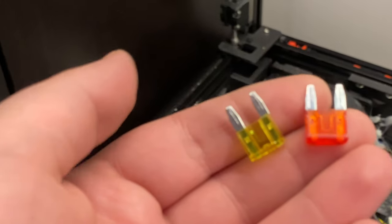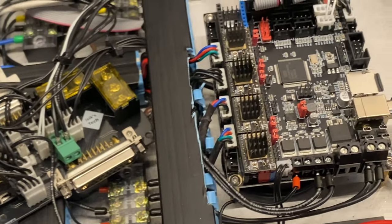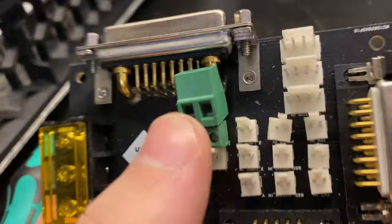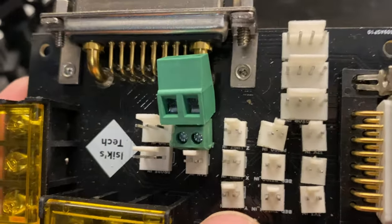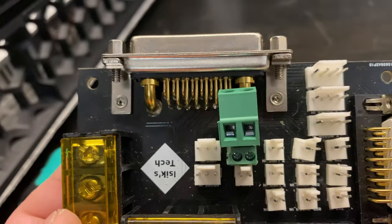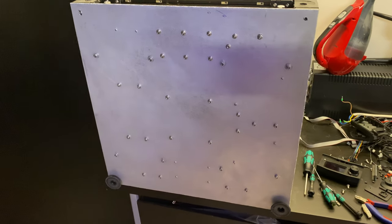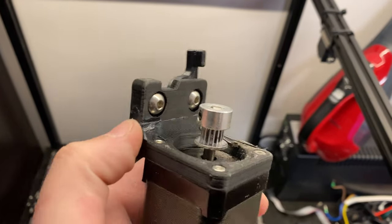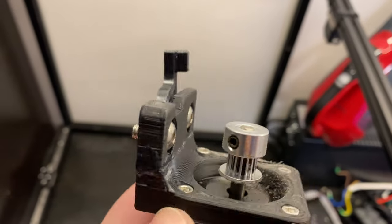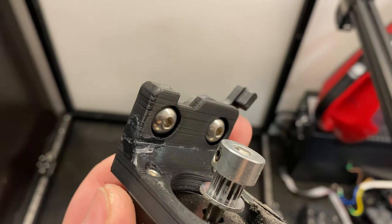The fuses are not blown, so that's not the issue — something else is killing that board. My bet is one of the stepper drivers. I also forgot I had this — the hot end heater was planned for just a regular JST connector, then I changed my mind and added the terminal, which is fine but definitely not the world's most elegant solution. I broke this part many months ago when I was first doing the 2.4 upgrade, didn't have a working 3D printer, so I super-glued it with the intention of replacing it, and obviously never did.